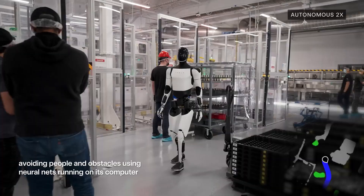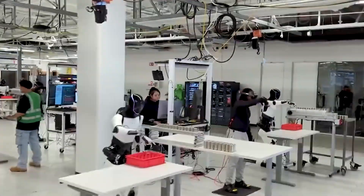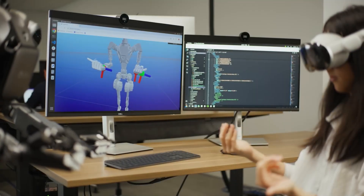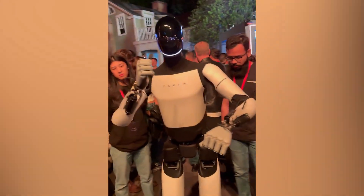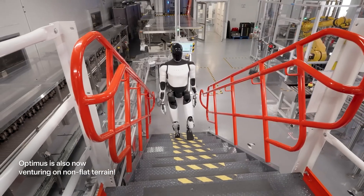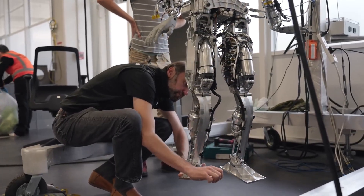This mechanism is paired with a custom-designed actuator system built specifically for Optimus. Instead of using conventional rotary electric motors with fixed gearboxes, Tesla has developed 32 linear and rotary actuators capable of delivering 100 Nm of torque and speeds of 500 revolutions per minute with extreme precision. These actuators work in conjunction with 128 force and position sensors at each joint, providing real-time data at a frequency of 1,000 Hz to the control system, allowing Optimus to maintain balanced posture even when moving over uneven surfaces with a 30-degree incline or after sustaining an unexpected 40G impact — a shove test conducted in the lab by engineers.